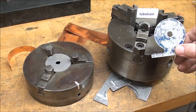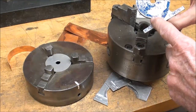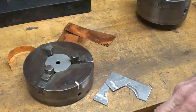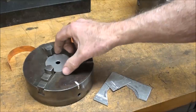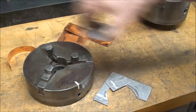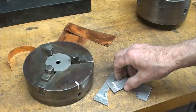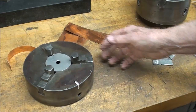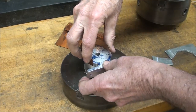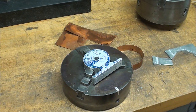I'm going to continue working on the stator. There isn't too much left to do on this, but notice that this will not fit into the larger chucks. The next operation is boring this inch and a half, but it fits just perfectly into the smaller Atlas 3-jaw scroll chuck. For the packing here, I don't want to drill into or bore into the chuck. However, this is about a one and a half inch hole almost, so there probably wasn't too much danger. But I still like to back it up with some packing — what's left of the packing I used on the rotary table the other day. I also like to put a little copper around this to protect it from the waste jaws. So let me get that on and mount it on the lathe and I'll see you over at the Atlas Craftsman 12 inch presently.